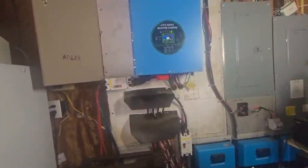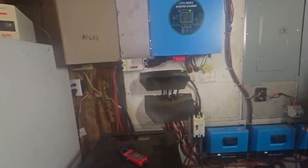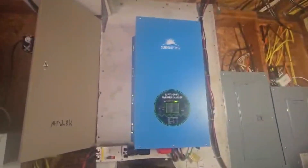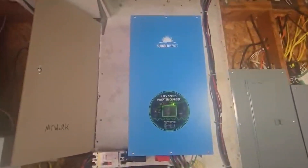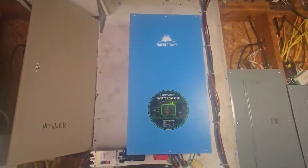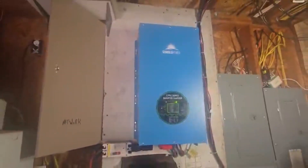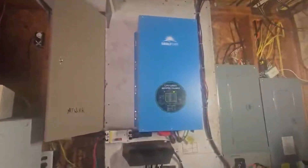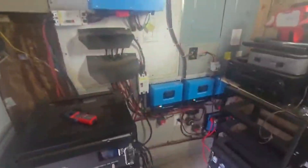I would definitely set up a hybrid system with the ability in the summer to switch over and have a separate net metering system selling power back to the commercial grid. The most important takeaway is to get as many panels as you can with as high an output as possible. Don't waste money on used 320-watt panels - buy big new panels, because in the winter you're going to need every bit of production you can get. Thanks for watching, give us a thumbs up and hit subscribe.